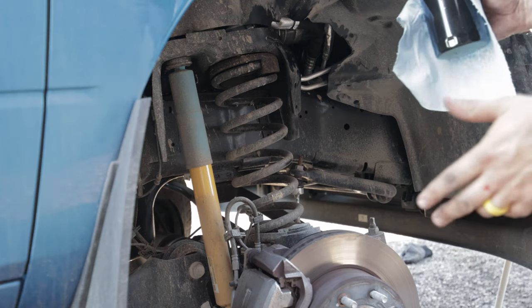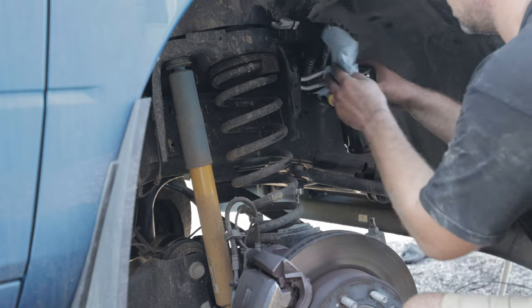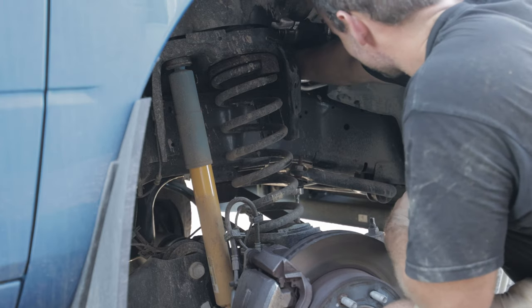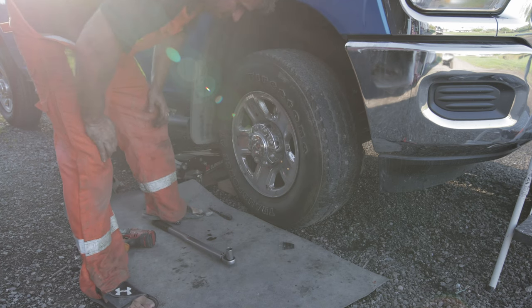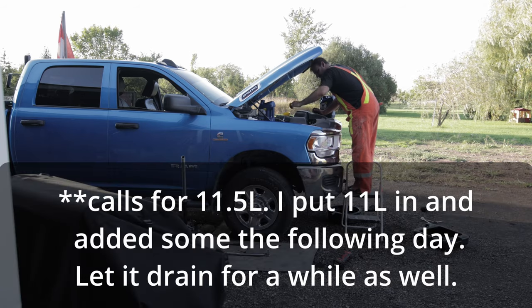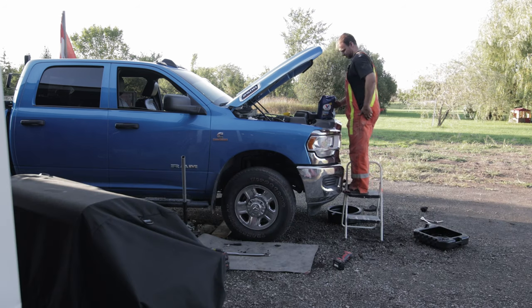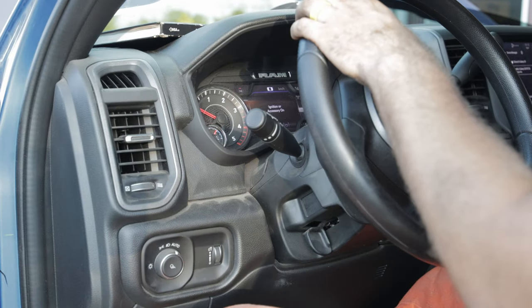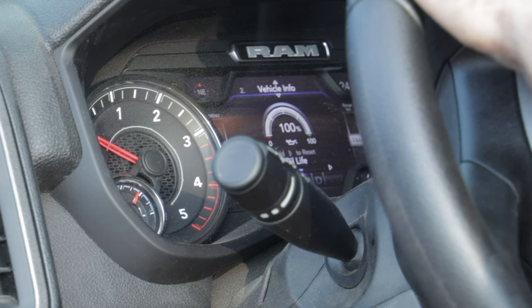I filled the filter about half and I'm going to try to get it up and in there without making a huge mess. Obviously if I had Gino's special tool it would be super easy — there we go, that's not so bad. Got the funnel in. It's calling for 12 quarts, 12 liters. I'm going to put probably 11 and a half in and run it for a day, then check it out. All the jugs are in. Hold the reset — there you go, back up to 100. That was a little more painful than I wanted it to be, but the next one will be nicer, I promise. Let's get on to the fuel filters.